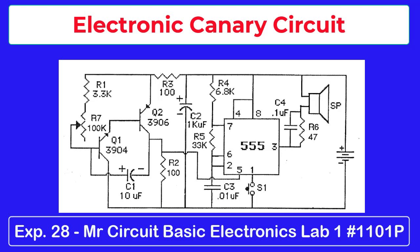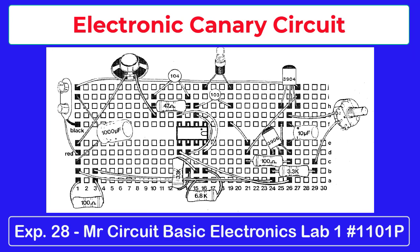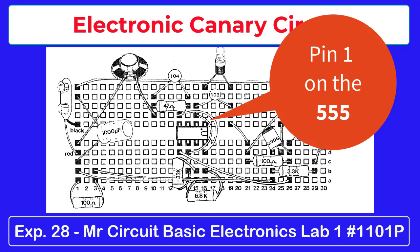This is the most complex circuit so far, so work carefully to install the 26 items in the correct places on the solderless circuit board. I want to point out something before you start: most of the experiments we have done so far have pin 1 of the 555 timer IC in the lower left corner. In the next three experiments, including this one, the 555 timer has pin 1 in the upper right as you are looking at the pictorial diagram on the printed page. If you don't install the 555 timer IC in the correct orientation, the circuit will not work, and you may damage the IC.